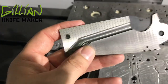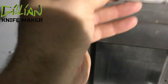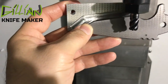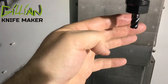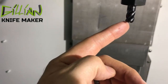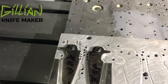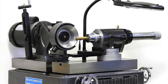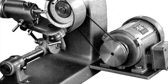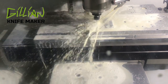Another approach I've thought about but haven't tried yet is to turn the knife up on its edge in the vise and have the end mill come in at the plunge and go down the full length of the cutter. The way I'm doing it, I'm only using a small radius of the cutter at the bottom, which is pretty hard on the end mills. One tool I really want to buy is a cutter grinder so I can resharpen my end mills. After this side roughs in, I'll stop and show you what it looks like.